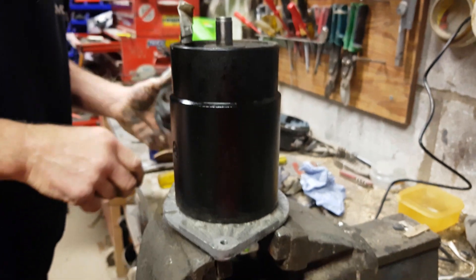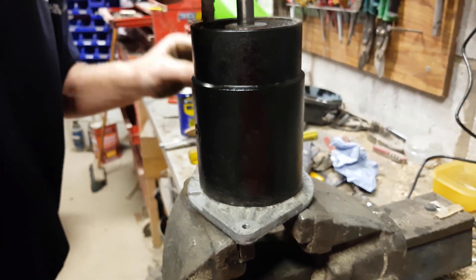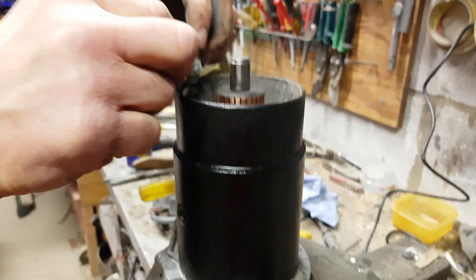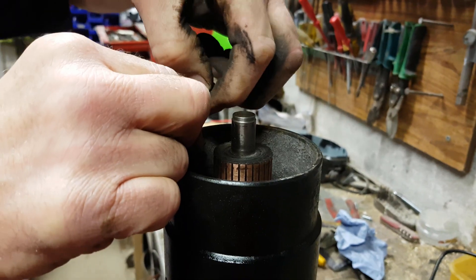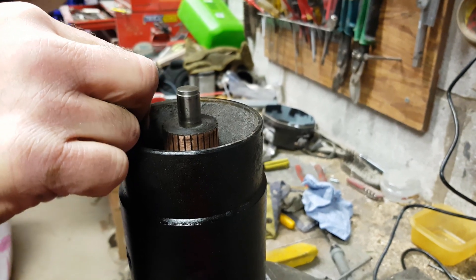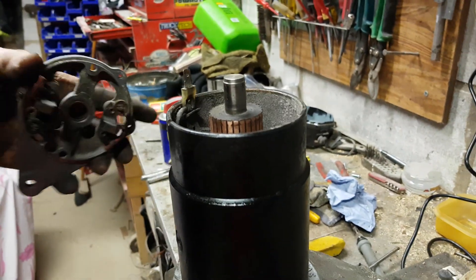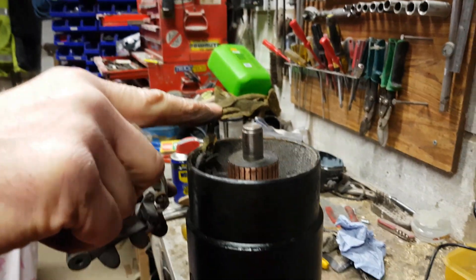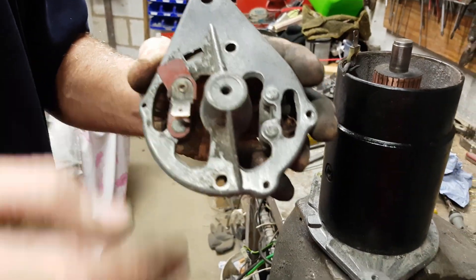It's a Lucas - not George Lucas! Now, taking off the wire: which is the main 12 volt wire, and then there's the small wire on the back. That's the field winding - that's the one that puts the charge light on and off in the car. And this is the one where the power comes down.